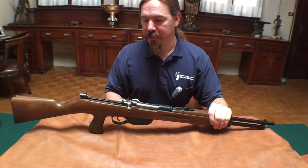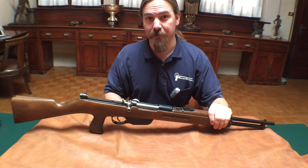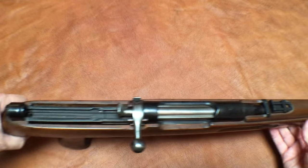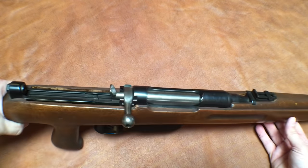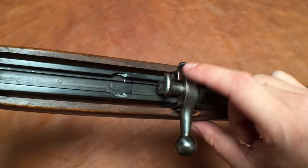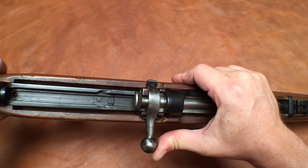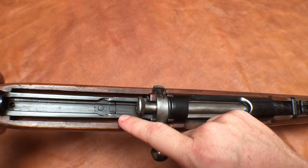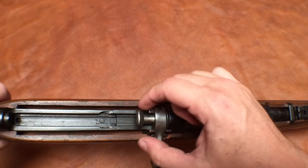Let's take a little bit of a closer look at some of the details — I'll give you guys a hand if you do want to take this on as a project. So here's the working bit: this is a completely unmodified Steyr M95 action; nothing has been changed there. However, you can see this block right here has been added to hold on to the bolt. And then there's a track, a groove, in between this receiver extension and the wood stock, and that gives this block a place to travel.